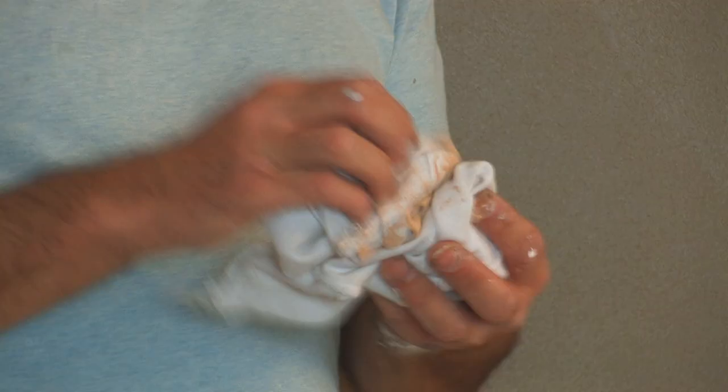I have my painter's rag filled with paint right here. I take another rag and I gently take off any excess paint, because I'm going for a light, very light finish. So you want to dab it until it's just damp with the paint, so it doesn't have a big build up of paint.